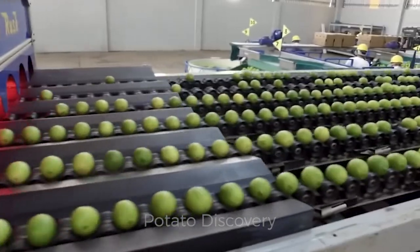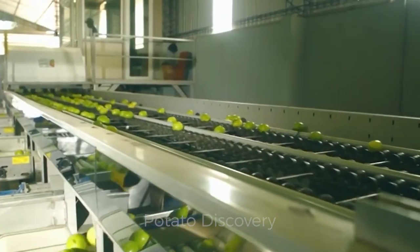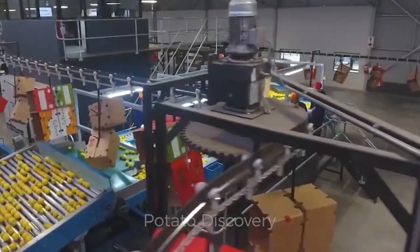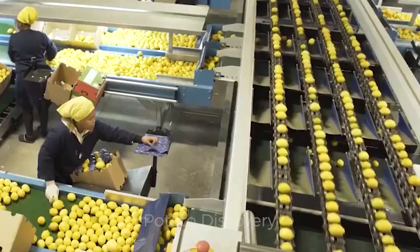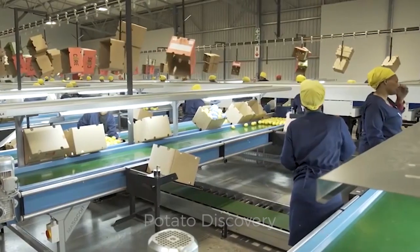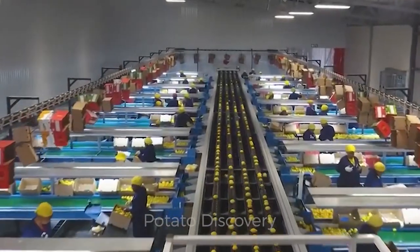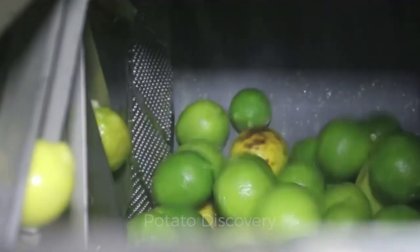Let's go! Before considering the equipment in detail, the requirements for lime fruit processing should first be assessed on the throughput of the crushing unit relevant to the quantities of fruit to be handled. It is generally accepted that the best compromise from the point of view of both quality and quantity of lime products is obtained by processing mature but not fully ripe fruit, for example half yellow, half green limes. Juice from fruit that is not fully ripe is said to have a more interesting flavor than juice obtained from fully ripe limes.